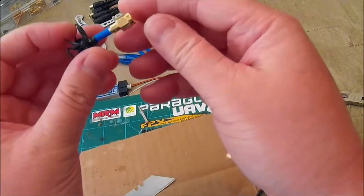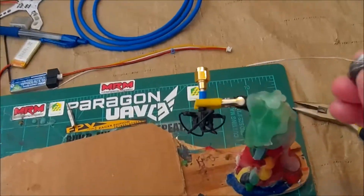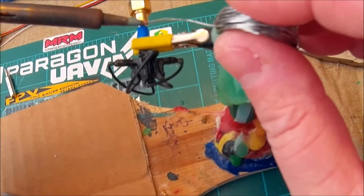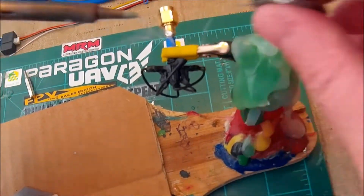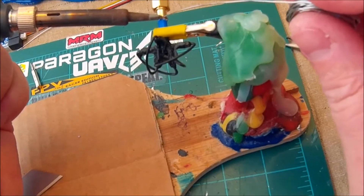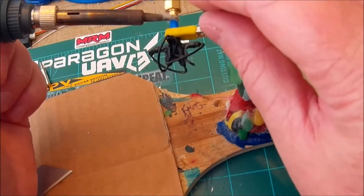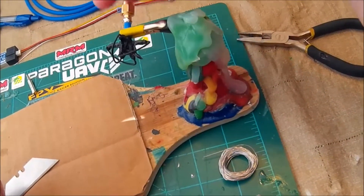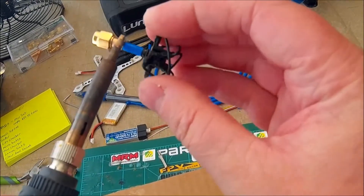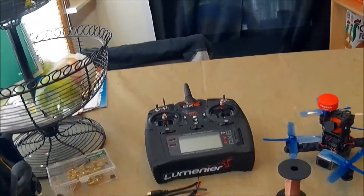The pin is exactly where it should be and I've got a little bit of room to solder there. I'm just going to stick the iron on it and start soldering — put a big blob right here, then turn it around and put another blob on the other side. Make sure you don't get solder up inside where it spins or else it won't spin anymore. Then I'll remove it from the helping hand and just touch it and turn it so that I get the solder all the way around. That looks real nice.